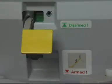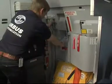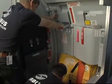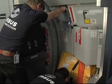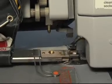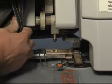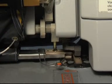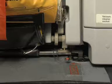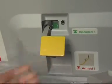Set the door to the armed configuration and open the door. Open the door with the control handle and hold the door to prevent it from fully opening. Install the girt bar with both ends into the floor attached fittings until the spring poles click into position. Carefully lower and lock the door with the control handle. Make sure that the control shaft levers engage correctly in the holes of the girt bar. Make sure that the girt bar engages correctly in the telescopic forks when you set the door to the disarmed position.